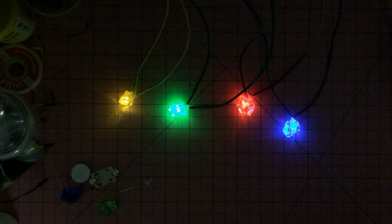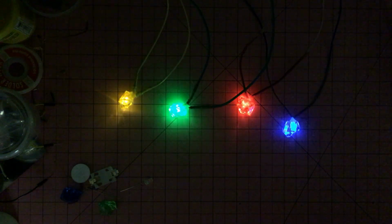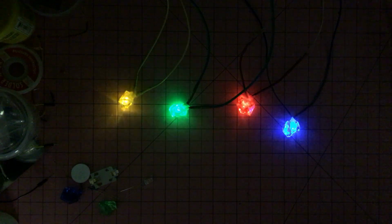Now, here's some interesting toys. So these are particular types of LEDs which have a linear feedback shift register inside, providing air quote random changes to the LED brightness. And they're actually quite efficient. They're running off a CR2032 3 volt little coin cell battery, and they can do that for weeks, depending on a lot of factors like the forward voltage, in other words, the color of the LED, and also the configuration of the resistors going to the battery.